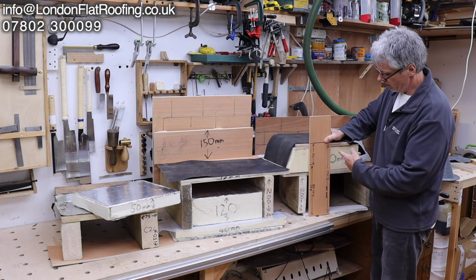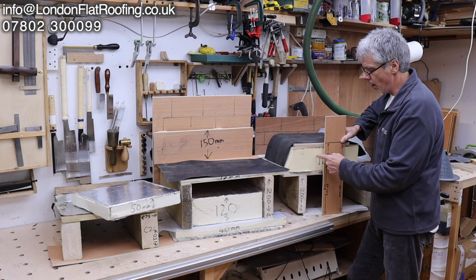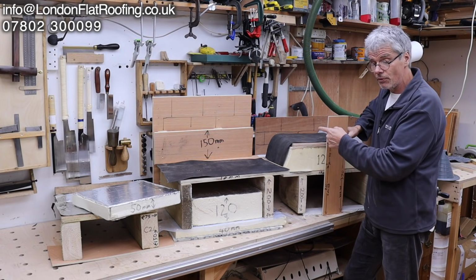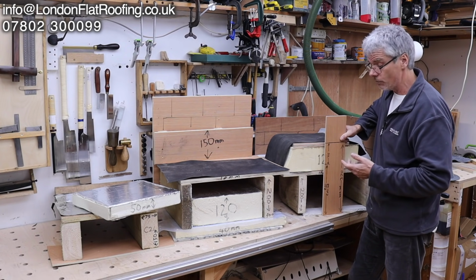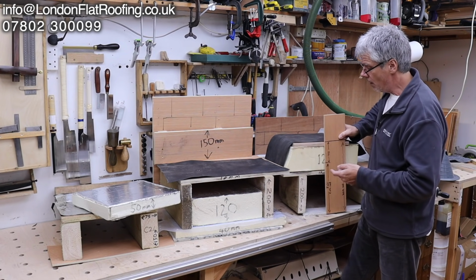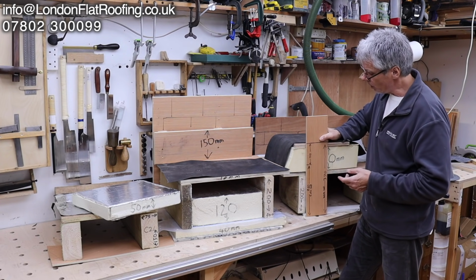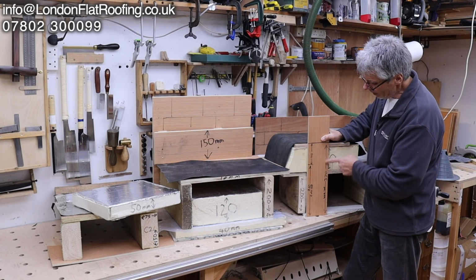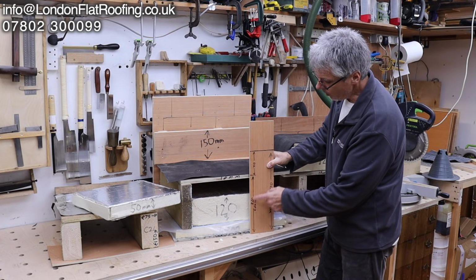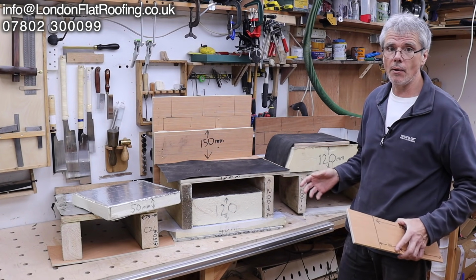By the way, with 120mm insulation, this is only good for retrofit. If we were doing a new build, this would have to be 150mm of insulation to get to the correct U value for today's building control. But you just take this, because most of the stuff that we do is retrofit, and a lot of people out there are just doing stuff where they can get away with 120mm at today's standards. So, 370mm from bottom to top. Here, 260mm. 110mm is the difference, and this is where everybody's going, hybrid.